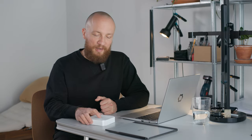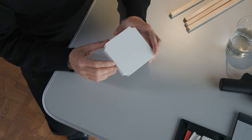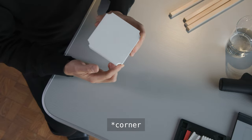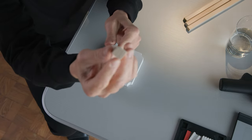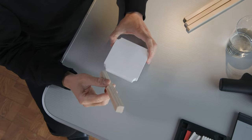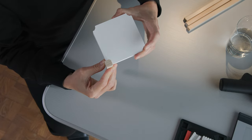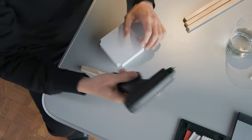So let's go ahead and have a close look at the mock-up I have printed out. Starting with the EPS compartment as the core, a lot of the dimensional accuracy will have to come from this part. My idea is to have almost dovetail-like slots on each edge against which the rails would register. This is basically a mock-up of a rail with a slight fillet on the outside edge and a chamfer on the inside edge. My idea is to have these register against the other parts like this and then be bolted in place — for now a little bit of hot glue will have to do.